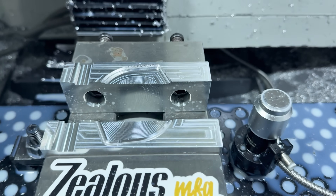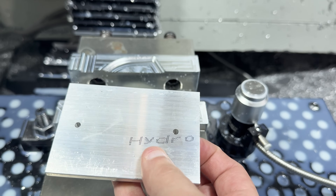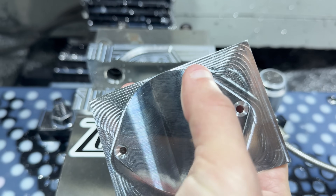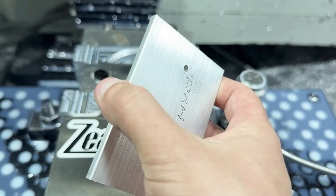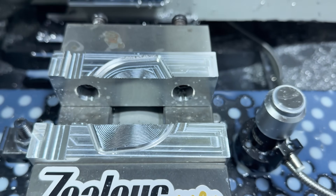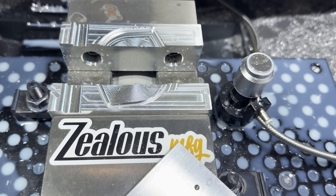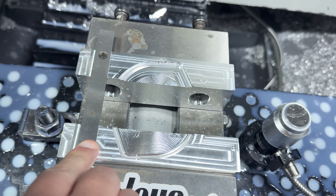Here's the item and here's the soft jaws. Some people thought, why don't you just put them like this? Well, I was a little worried if my soft jaws were a little too loose I'd have rock. Because I was only able to engage about here and here, and this is round, and then it kind of tapers. So I had very little engagement on that taper. I decided to angle it so I'm getting more contact here. I know this orientation is pretty solid, and I have the parallel slot for the jaws so we can realign it if we need to.